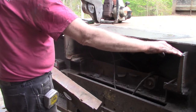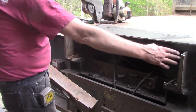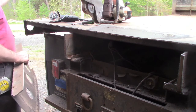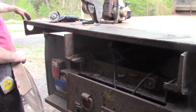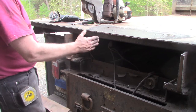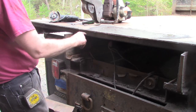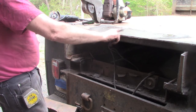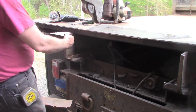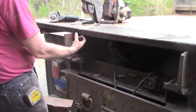So I'm going to replace the tail end of the bed with box tubing that's super strong and can take the abuse and act as a foundation to tie the left and right horizontal cross members, and then extend all the way out to pick the vertical tubes up where the tailgate and everything is going to attach. So my first installation of structural material is going to be a full width 2.5 by 2.5, 3/16 wall box tube. That'll be fully welded across here, and that'll begin where the structural cross members, 2x4 tubing, is going to be welded into the bottom of that.